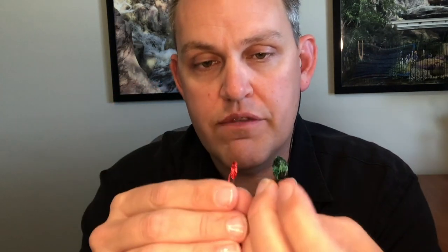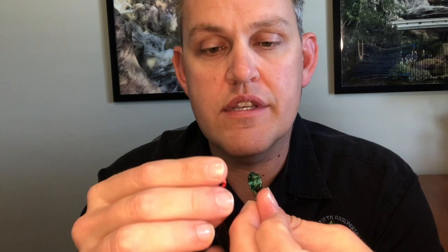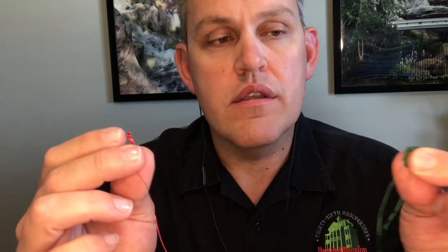They're wound in such a fashion where they both create the same polarity at the same time. So you don't have to worry about mixing up polarities inside. The wiring's done internally, so all you see is two cables, one coming in, one going out. And they're typically wired in series with the next motor on the opposite side of it. So that's how a stator is constructed internally.